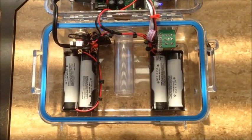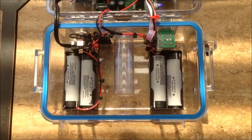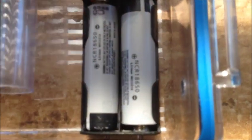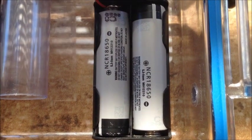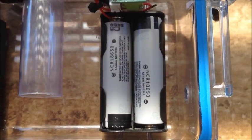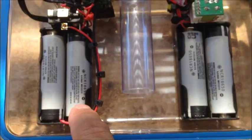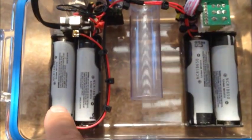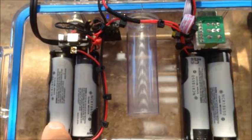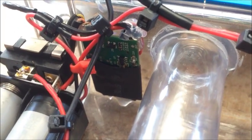Here's the inside. Starting with the batteries — these batteries have to be taken out to charge and they have super capacity, tons of charge. Each one is a 3.7 volt Panasonic lithium battery, roughly about 2800 to 2900 milliamps. The first three are wired in series for almost 12 volts, which powers the t-class amp, and then the last one is powering the Bluetooth module.